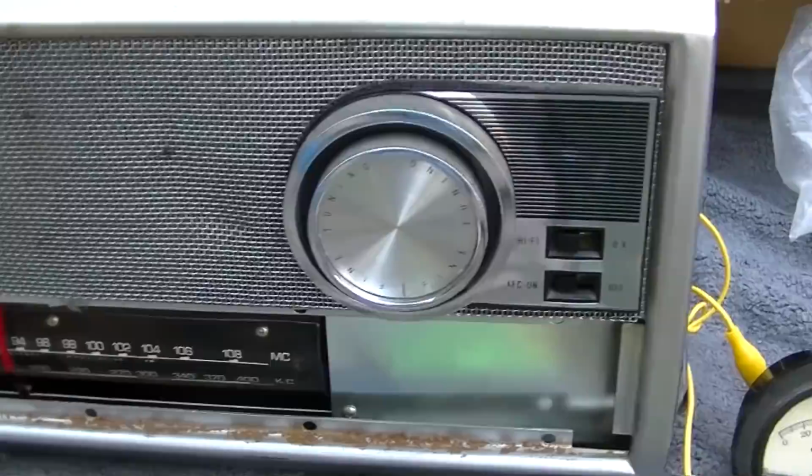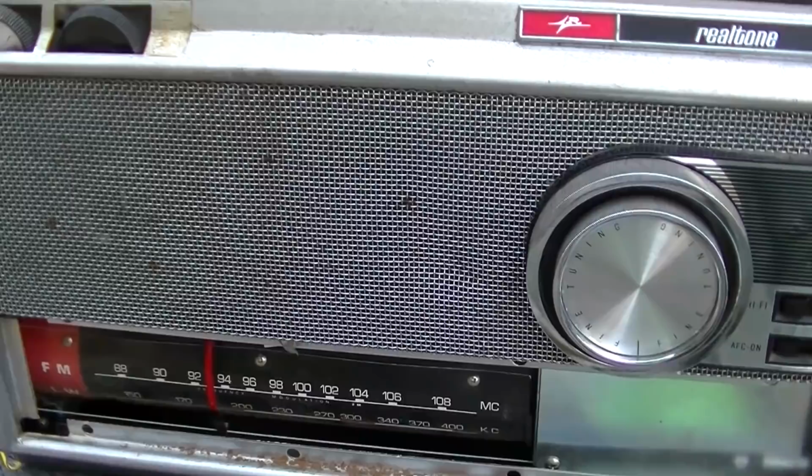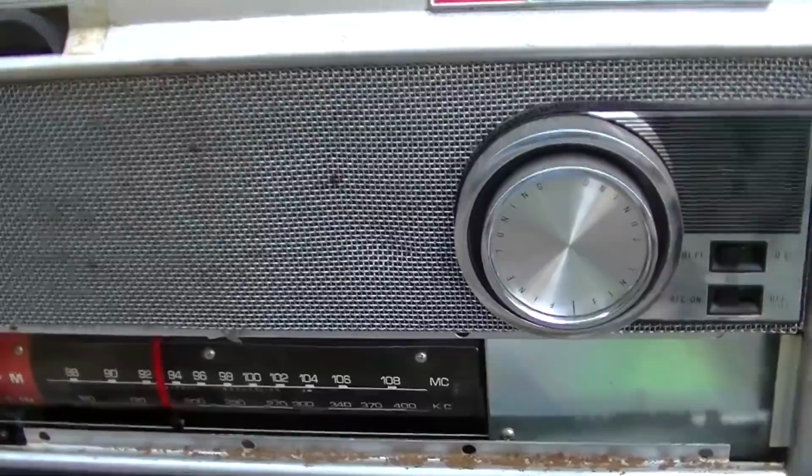Sometimes on this channel, I should just make stuff up. I should just say, yeah, I converted it to silicon. I changed the two emitter resistors from 470 to 1,000 and adjusted the bias pot, and it's working awesome. And it should just blow some smoke, and most people would never know, but the honest truth is it doesn't quite like those silicon transistors.